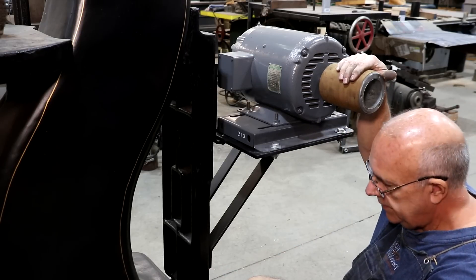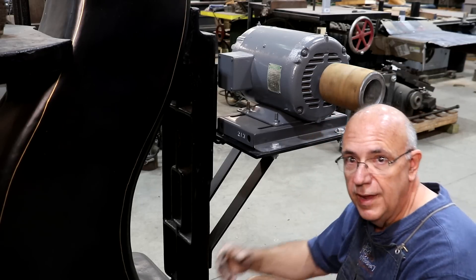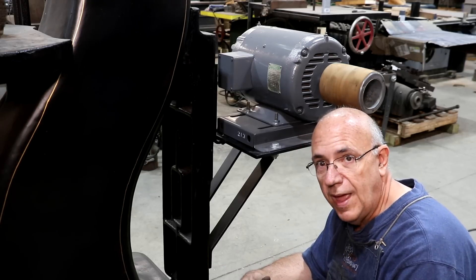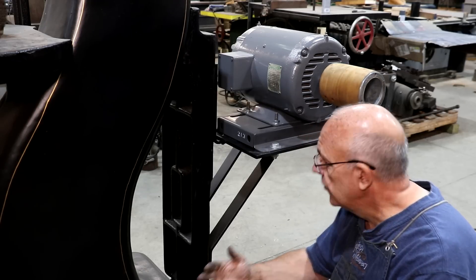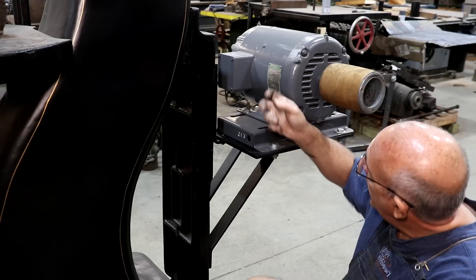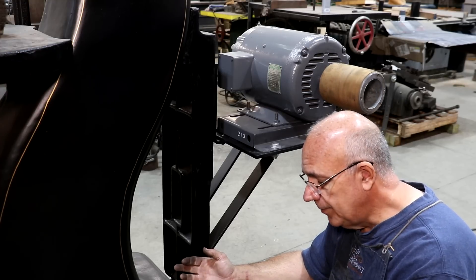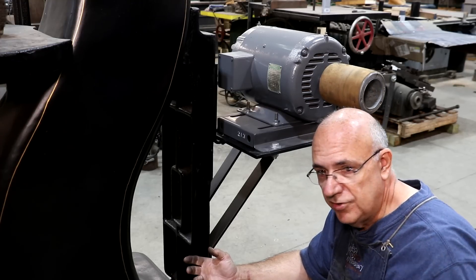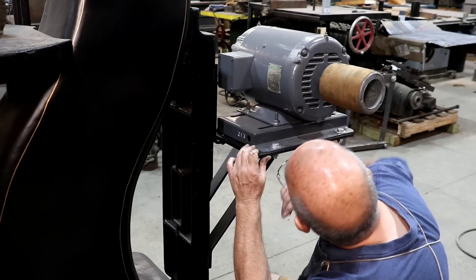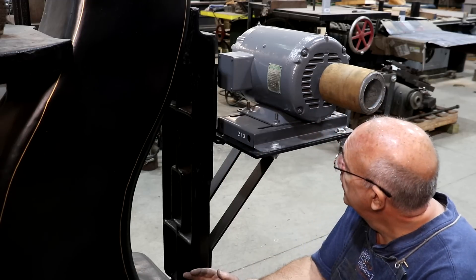Now that we've got the motor mounted, the next thing we do is hook up the electrical stuff so this thing will work. I need a motor starter for this. A motor starter's purpose is it is a switch that turns the motor on and off and also has protection for the motor to make sure that it doesn't get too many amps to it. Most motors are going to have on the tag how many amps they're rated for — the maximum amps they'll draw at startup. This one here running at 220 volts is rated at 22 amps on the low end.